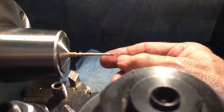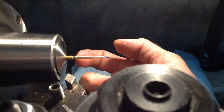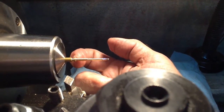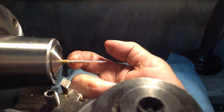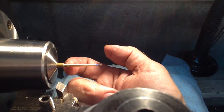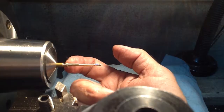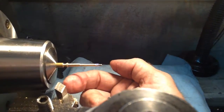The other tip I had — I was just about to cut this one off. Using the DRO, I've made sure everything's the proper length. The diameter of the finished cone needs to be less than an eighth of an inch so that it can go into the hole in the valve. What I did was machine this down — I used a cutoff tool and made myself a little space.